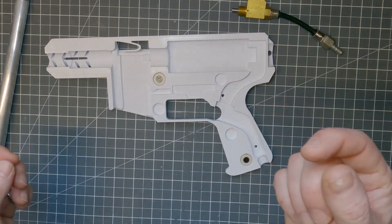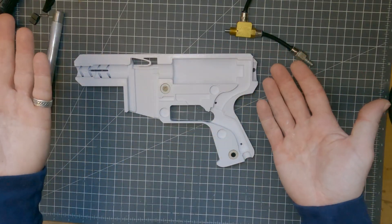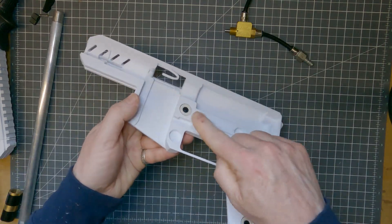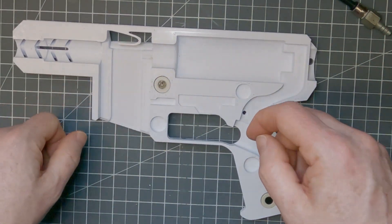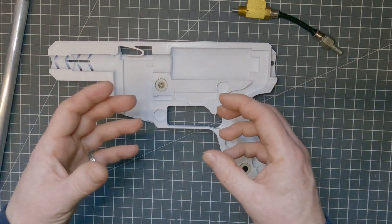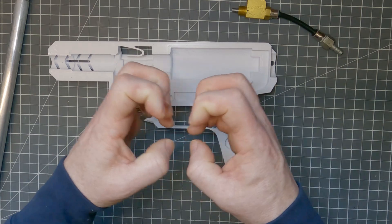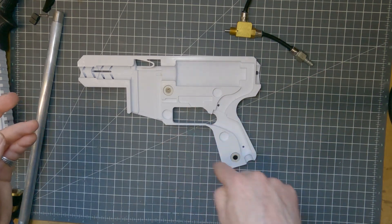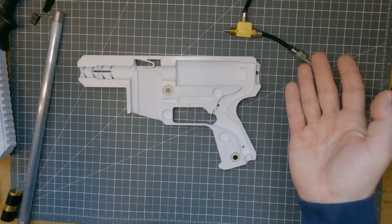So this time I've gone with thinner magnets — three millimeters deep. The supplier I use separates them with a little plastic spacer, and I've actually glued the spacer to the magnet to fill out the extra space in the hole. This protects the magnet surfaces from smashing against each other, and reduces the holding strength. The strength of magnetism varies with the square of the distance, so adding a couple of millimeters between the magnets means the effective strength is a little lower. Depending on your magnet strength, you might need to use all five locations.